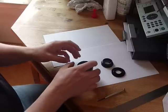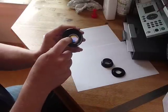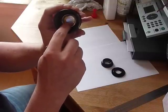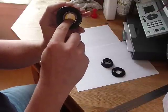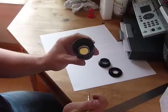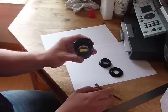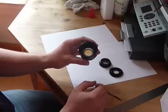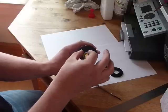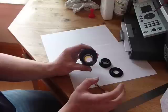Inside, importantly, what we've got here is this white O-ring and that compresses down onto the top surface of the echelon. The echelon sits in there and you can see there's a lot of lateral play in there - even when it is in place there's still a good few millimeters of lateral play. I think this is one of the reasons why we're not getting even fields across the field of view with PST mods. What I've done with my other echelon is just centralize it and screw it back in - that seems to hold it for a while. I think of it as a bit like collimating the echelon.